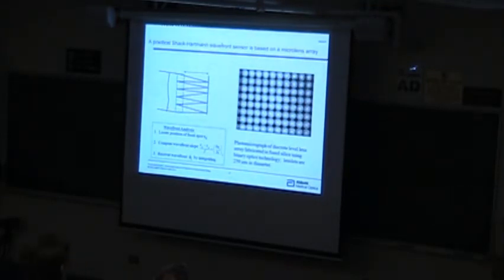So again, the thing that we primarily measure is the focal spot position. We do that usually by looking at a group of pixels assigned to that lenslet and doing a centroid calculation of some sort. You'll put some reference beam in, some really high quality beam. That could be a collimated beam, or it could just be a spherical wave. And the advantage of the spherical wave is it just comes from a point source, which is very easy to generate. And then you subtract the reference from it, you divide by the focal length, and now you have the slope of that particular beam. Then that just is the gradient equation that you have for the slopes in 2 dimensions, and you can get the phase by integrating that.